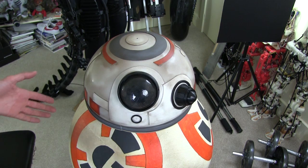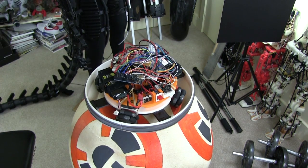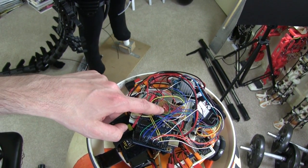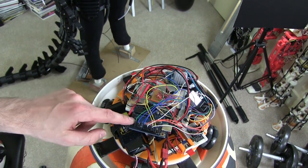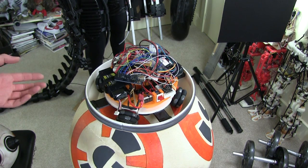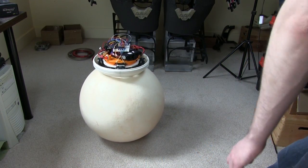What we've got is an empty polystyrene ball, which is completely hollow, and all of the clever stuff takes place in the head. I've got basically an accelerometer and gyro unit, which is from SparkFun Electronics. Have a look at the website or part one for a rundown of the parts. We've got an Arduino and a motor driver basically, and it tries to balance by staying on top of the ball, which works relatively well. I've had this working through most of the episodes from part two.